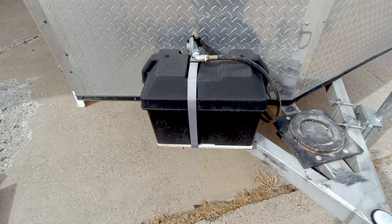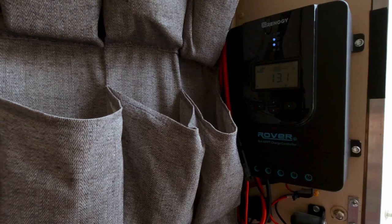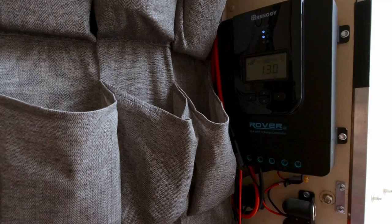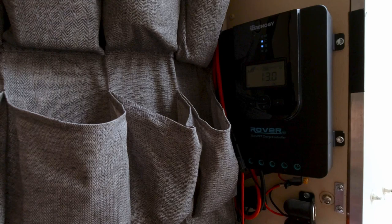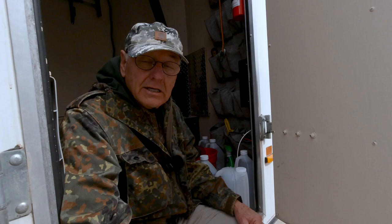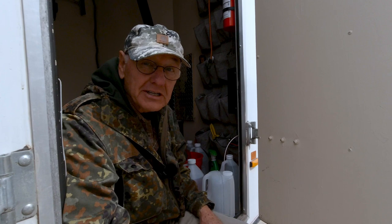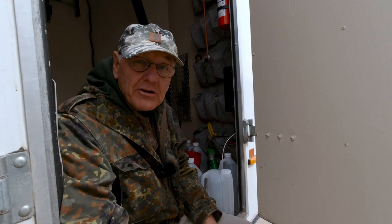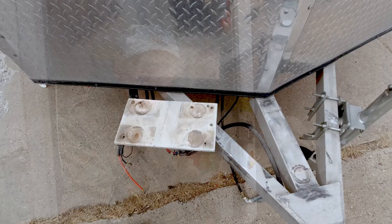As for what we're going to do with this battery, I don't know. I've got a Renogy controller inside and this is all about charging the battery. I guess I'm going to be putting another battery on inside the trailer — maybe an AGM or a gel battery. But if I decided not to put a battery in, then this would be useless, and I went through all the trouble of installing it and it's all connected to the solar panel. Because I could just run the whole trailer off a Jackery or a Bluetti or something — it would run everything just fine: lights, refrigeration, the works. But I installed this Renogy and I want to use it. If I put a lead-acid battery inside the trailer I'm going to have to vent it because it puts out hydrogen and that's an explosive. If you put in an AGM or a gel battery you don't have to vent it because they don't give off gases, but they're like two or three times the price. So the jury's still out on what I'm going to do with the battery.